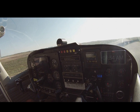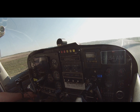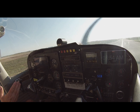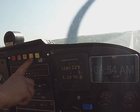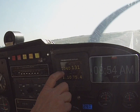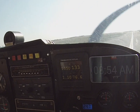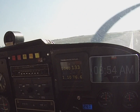We have initiated a fault in the aux system so you can see what the SCD would annunciate if there is a fault. Taking the key from main to aux — notice the engine died for just a brief second but came right back up. We have an aux fuel pump lamp steadily illuminated, meaning the aux pump has been commanded on normally. This is what a fault looks like on the SCD: it will be either a yellow or a red annunciation — red for critical, yellow for cautionary.